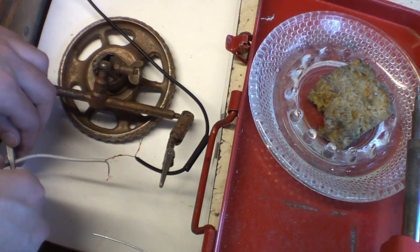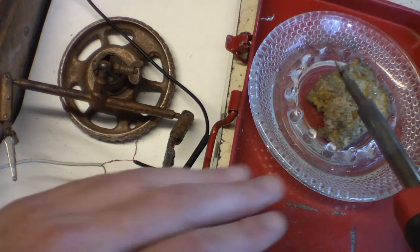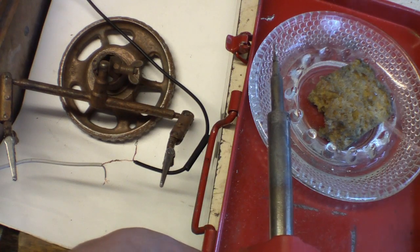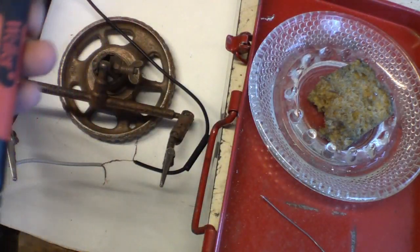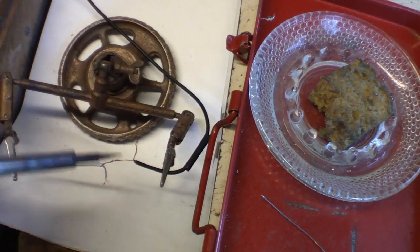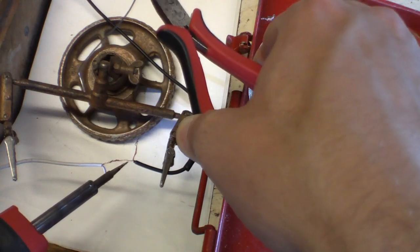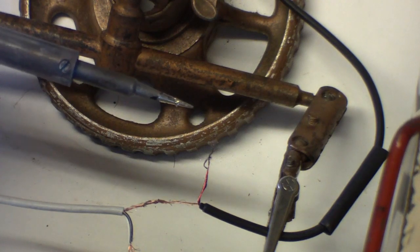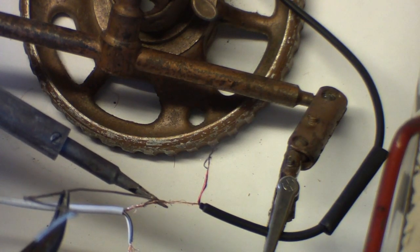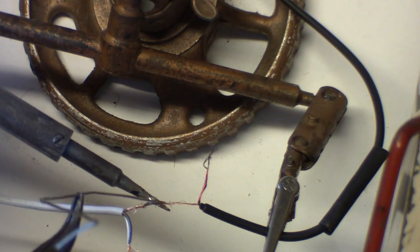This phone cable is easier to just braid together. Then you want to tin the soldering iron — wipe the old solder off, take your new solder, put it on. Remember that heat always goes up. You also want good lighting; this soldering iron has a built-in light which is helpful. Carefully put the iron under the metal and then apply solder like that.